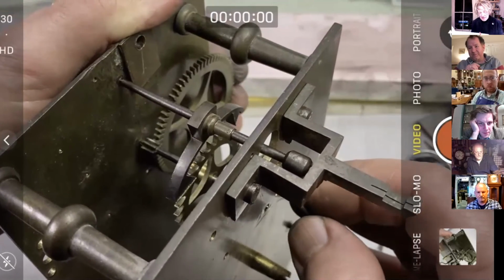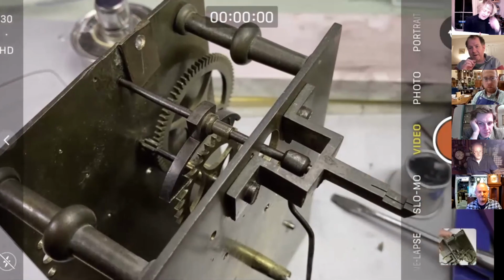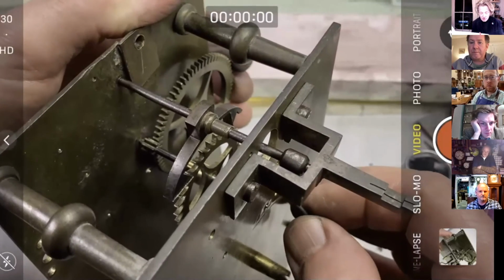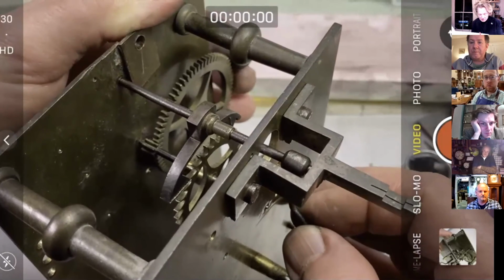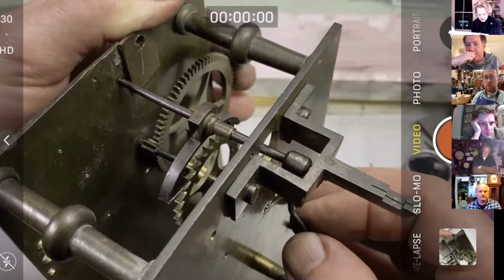Now that could be a few things there. We haven't quite investigated it enough yet. It could be that the wheel, we know that it's not perfectly concentrically mounted, so do we re-collet it? It could be ovalized, it could be these rogue teeth, or is that it? Yeah, it's out of round, or eccentric, or odd teeth. Or probably, it's a 200-year-old clock, probably some combination of that.